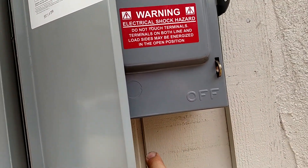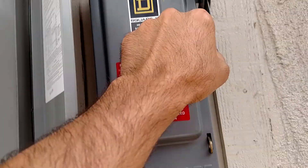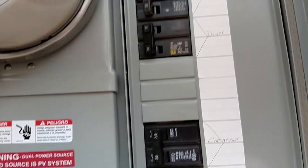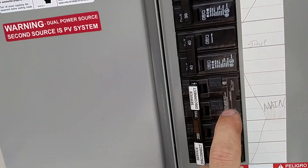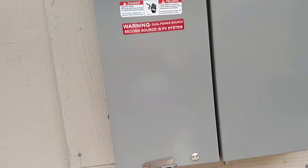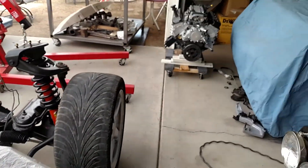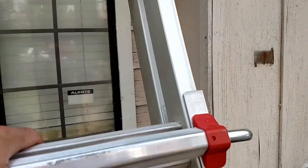It comes out from the bottom — I think it comes in here from the solar and then out from the top to the panel. And your solar has to be on the topmost area for the breaker. If your main is down here, then it has to be the furthest away from the main, which in this case is up top. So your solar breakers are the furthest away from your main switch. That took a while because I had to coordinate between me doing the work, Edison coming to pull off my meter, and the city coming out to inspect the panel itself. That's a separate inspection from the final solar inspection.